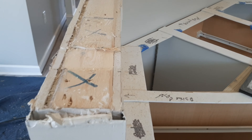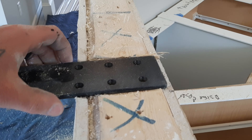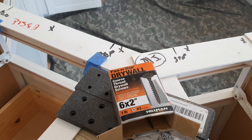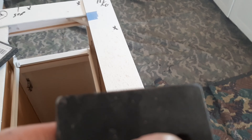All right, Sammy's got every one of those cut. We'll come back and sweep and vacuum all this stuff after. I'm going to show you how one of these brackets fits in here, then we'll get back to you in a minute. We're getting on about 11 minutes here so I'm trying not to make the video super long. So we'll pre-drill the holes, and I've got some six by two inch drywall screws and that's what we're going to pop in here. These brackets — the hole is bigger on one side than it is the other so that the screw faces will sit down in there. If you put a screw on the wrong side it kind of sticks up a little bit, but if you flip it over, it's inset — nice and smooth.